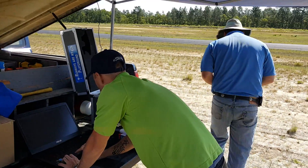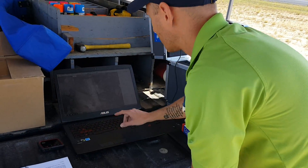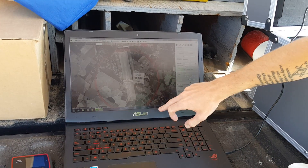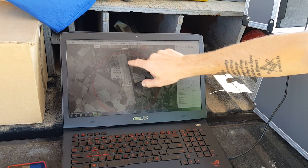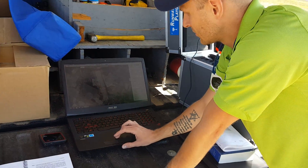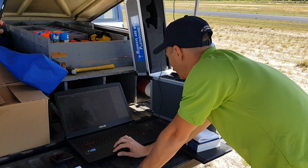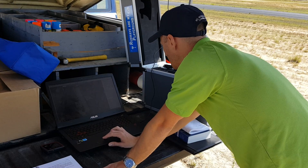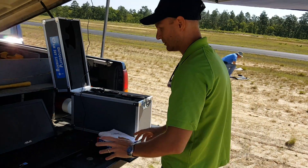Airframe check. So this is basically, if you look at this, this is our flight area — this is where we're going to be flying, in that polygon there. And this is our operating area. The operating area has to encompass the flight area before you can fly. So these are your flight paths right here. Right now we've got it set to fly at 691 feet, but I'm going to bring it down to about 500 feet. It's estimated we'll get about 2.1 inch pixel resolution for the imagery.